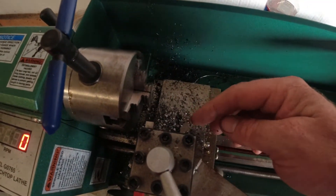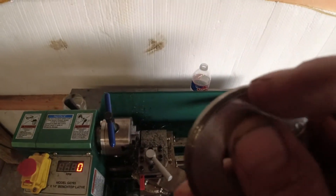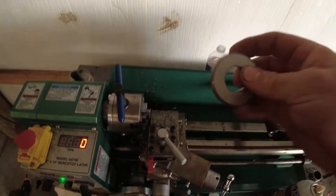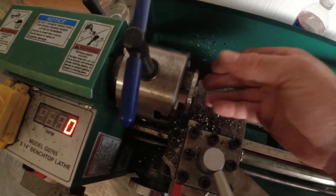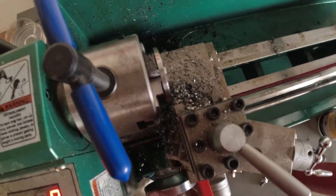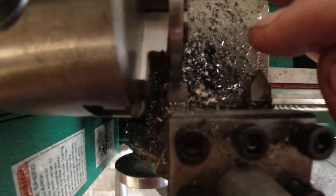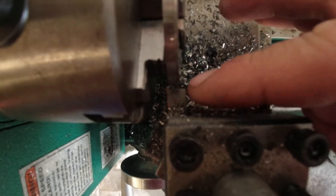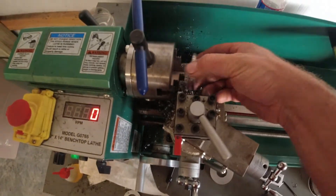I mic'd it out, got it with this. Cut me a groove, and then I took the flat one — just kind of like this right here. I came in with that flat one; hopefully you can see that. That flat cutter went right against it, went all the way down to my mark that I marked with this. And that worked out absolutely beautiful.